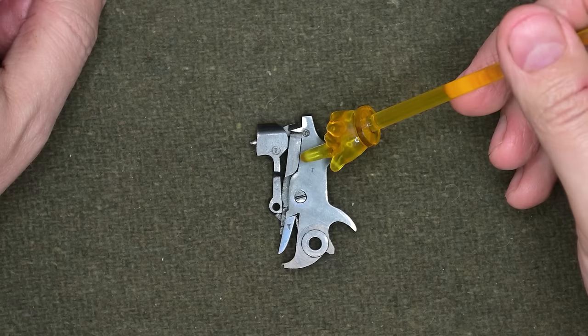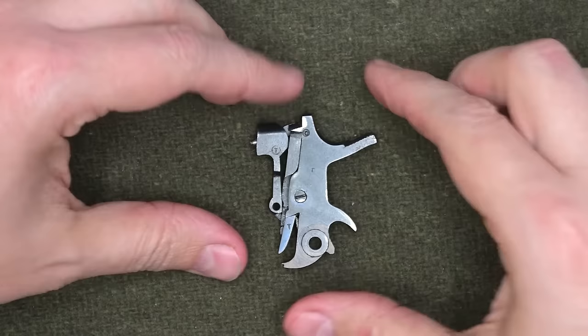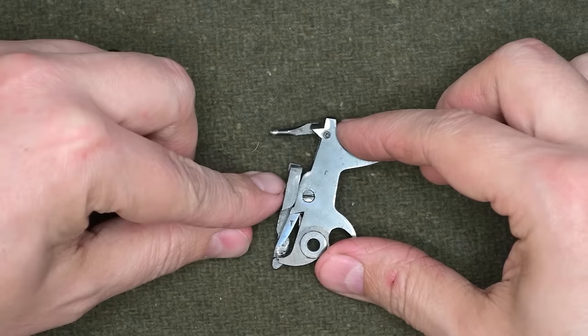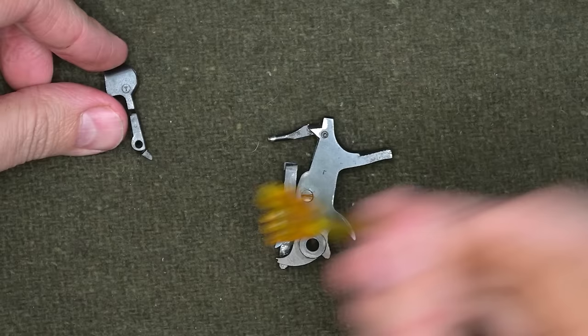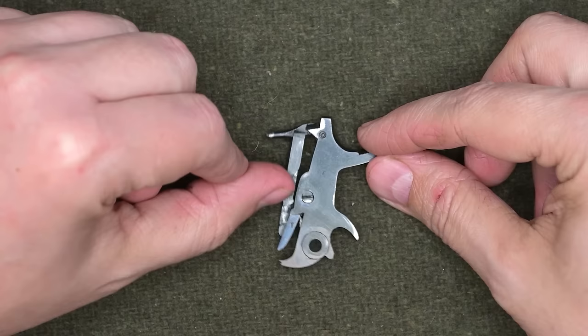So when the system lowers this back down and the hammer is returned to the rear, let me get this guy out of the way for a second just so you can see it. When this comes back down and the hammer is back, it can't fall. Remember I said it was locked? It can't fall because of the locking block. So it's working both ways. It's not just pushing on this side against the breech block, it's also pushing on this side against the hammer, acting as a very positive drop safety. That's good design. When it comes up, it meets that notch in the hammer, and therefore the hammer can fall